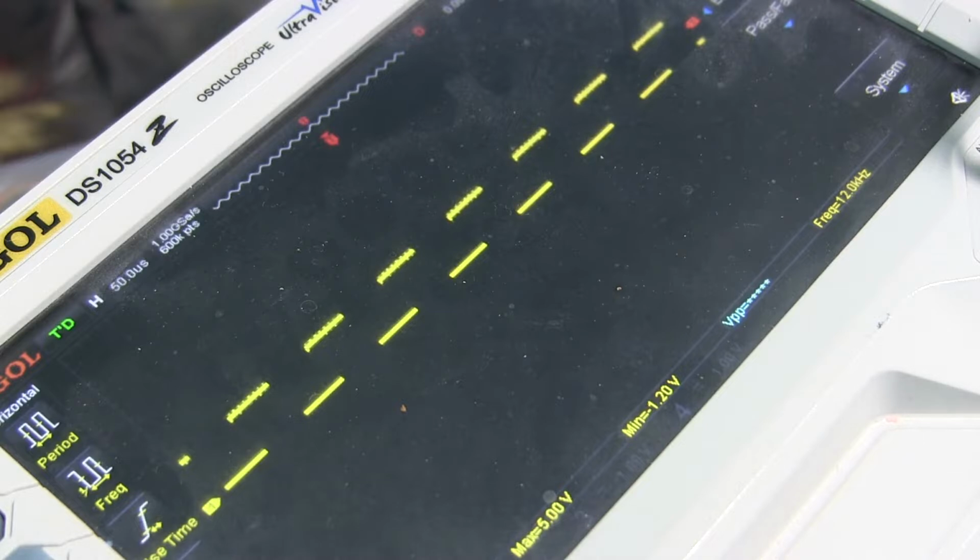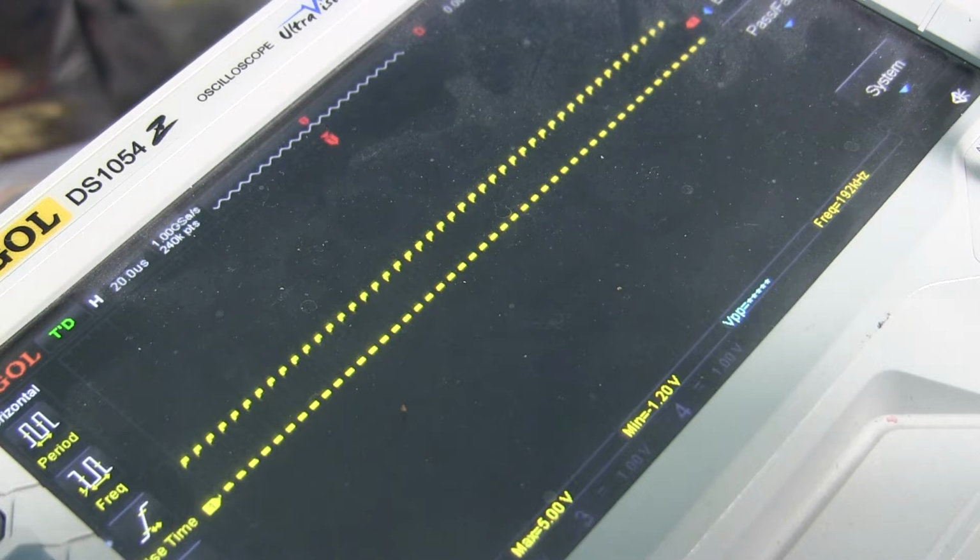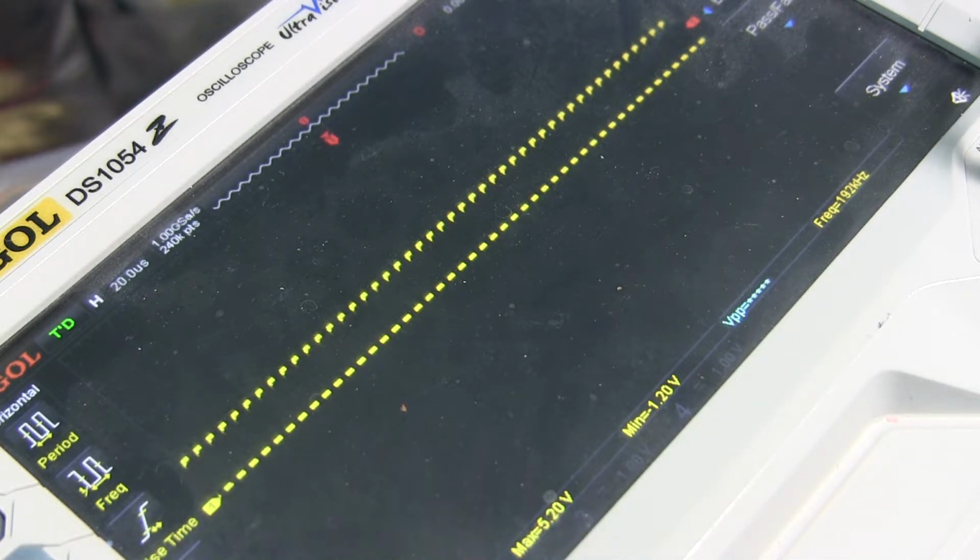No, I was definitely getting 15.6 on the other board. Okay, so there may be a problem here. I will have to troubleshoot and get back to you. Actually, I think I know what the problem is. I think I need to install the horizontal PROM, because that affects things. So I'm going to do some more soldering before I do more testing on the clock.